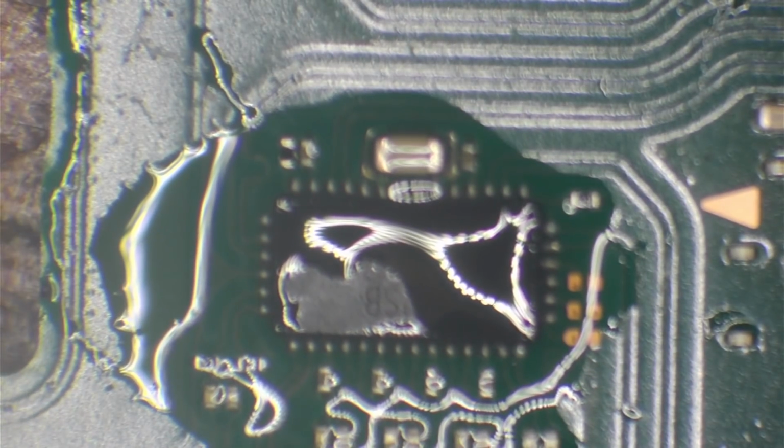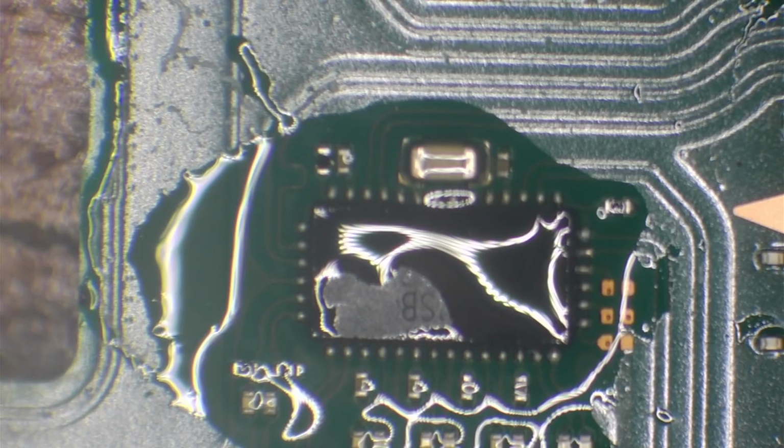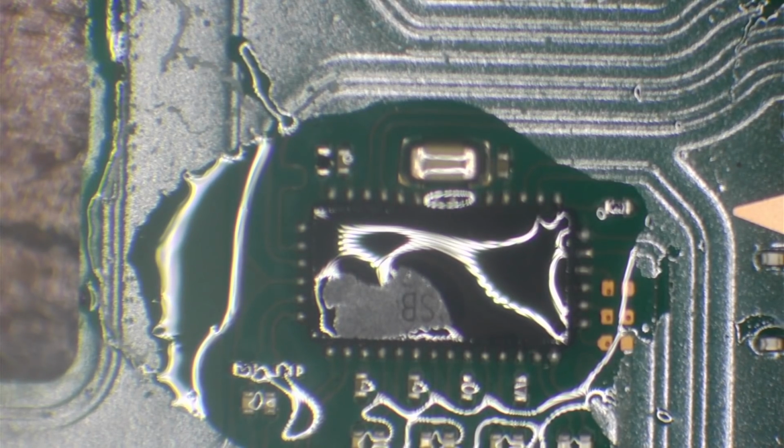and you're probably wondering now why I didn't replace the solder, and that's because it's absolutely unnecessary to replace the solder there. There's nothing wrong with the solder that was on there, so rather than risk knocking components, we just use the lead-free solder that's already on there. Just going to clean off that flux.